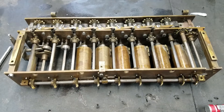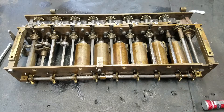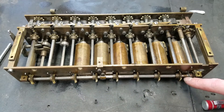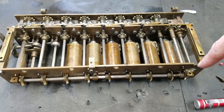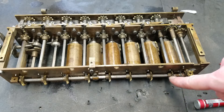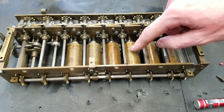I have the machine pretty far disassembled. I've had the carriage removed and the input slider plate also removed. With those out of the way you can get a pretty good idea of the working of the mechanism. This shaft here is the main drive shaft. The crank on the front plate is attached to a shaft that goes down here and has a bevel gear that meshes with this gear, which then drives this shaft all the way across. Each of these bevel gears drives a bevel gear on the inside of these Leibniz wheels here.